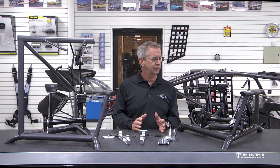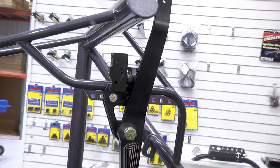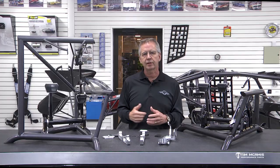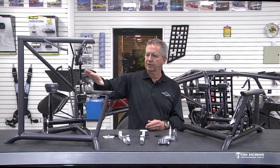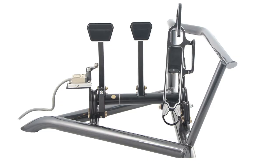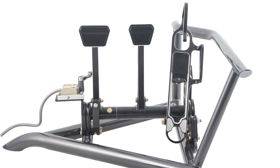It's pretty damn good the way it is right now. We've got all the different configurations taken care of — standard gas pedal, which would work on an EFI naturally aspirated or carbureted car, so you're going to have a throttle rod hooked to this, and they all have a toe return on them. Then there's the cable operated pedal, which we like to use in any type of blown car, pro charger car, anything with a supercharger or turbo.